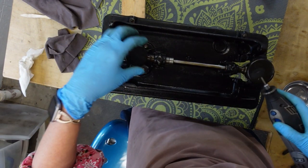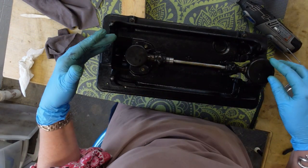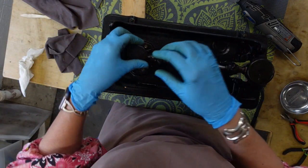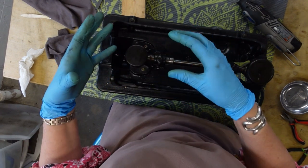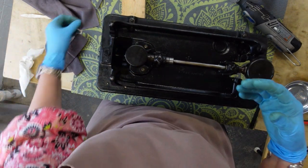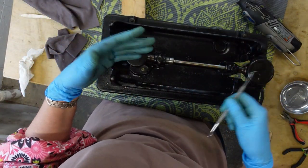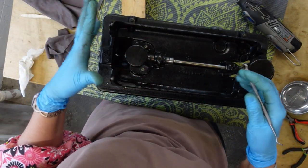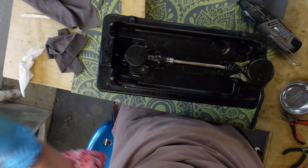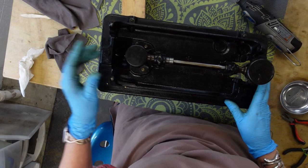So I'm kind of just taking it a step at a time, getting this whole shaft clean. And then I'm going to pull these. I am not spraying Purple Power on these gears at all. And so once I pull the gears off, then I'll just carefully take it step by step, making sure that there's no old grease. Because when I took a quick peek under this one, there was some hardened old grease in there. So just getting a dental tool to pick that out carefully, clean it down, put a light coat of very fresh, good grease on there, and then I'll pack it back closed. So that's my plan. Anyhow, see you next time.